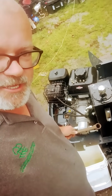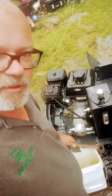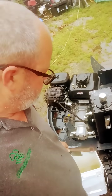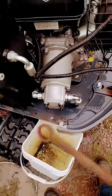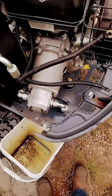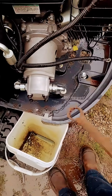Does the Chinese mini excavator H12 have a hydraulic filter in the tank from the factory? In the first video we didn't confirm it, but we're gonna drain it now and see if there's an internal filter inside this hydraulic tank. It is so much easier to access this thing if you take all the panels off, and there are several videos on here showing just how to do that.